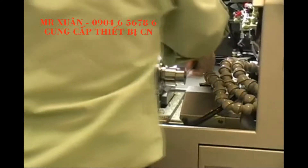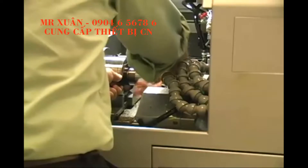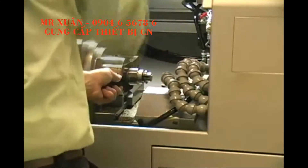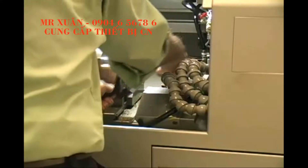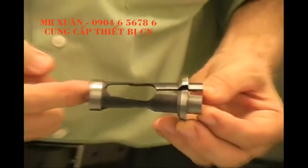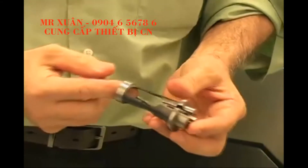To change or install a subspindle collet, loosen the threaded spindle nose cap using the appropriate wrenches. Pull out the collet and clean it before storing it in a collet rack or drawer. Hardinge subspindle collets are hardened and ground. The head angle and the back bearing are the contact areas between the collet and the spindle and are ground to precise TIR.